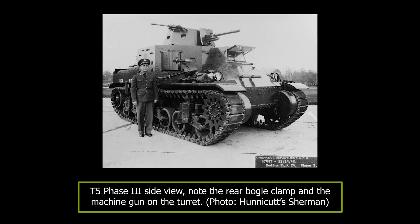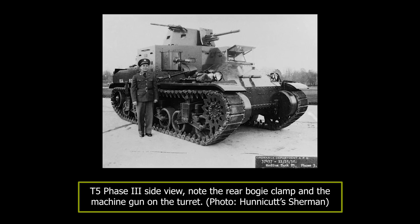With a final weight of 21 tons, the design now had a 14 horsepower-per-ton ratio. The maximum speed was raised to 53 km/h, but the range dropped to only 165 kilometers despite increasing fuel capacity to 499 liters. Due to the higher weight, larger tracks were needed, as ground pressure rose to 12.2 psi. Following a test program from November to December 1938, the tank was deemed satisfactory for service, though it was now one ton overweight. Unlike the Phase 1, which was almost directly adopted as the M2, the T5 Phase 3 was not directly adopted, but some of its improvements — notably thicker armor and a redesigned turret — found their way into the M2A1.